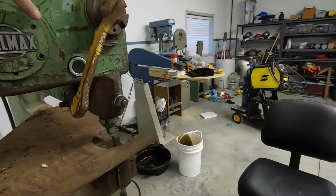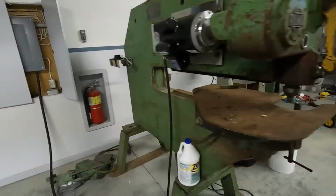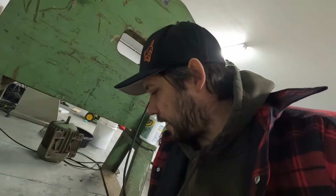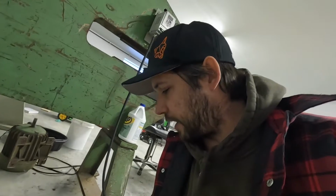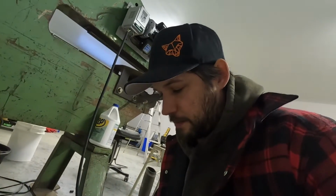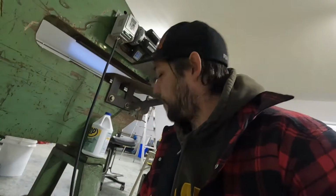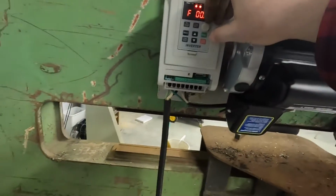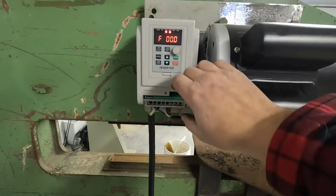I got some oil in. It's actually old airplane oil. My airplane runs 20W50, and some of the information I collected from guys who run these machines all the time, they say, yeah, just run 20W50. And luckily, I had some old stuff lying around. Now, these machines are kind of self-changing oil because they leak all over the place after time, so not too worried about it. Let's see, plugged it in, down as low as it goes.